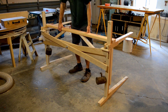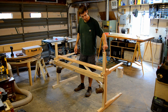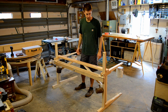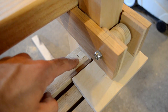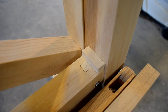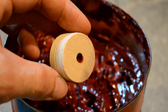We got everything together and gave it a test drive — it was stiff and squeaky. What's actually happened is that these parts here are racked just a little bit, and that ends up fighting the center part. They all need to be perfectly parallel to work super smooth. The racking issue is due to the cross-piece connection between the legs. I pinned it instead of gluing that joint because I want to be able to take it apart and break it down for transport. Unfortunately, despite drilling very close holes around those screws, there's still a bit of play in the system, and it gets multiplied at the top and bottom of the legs.